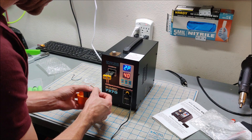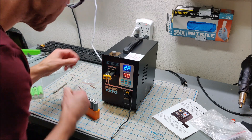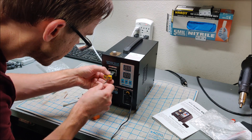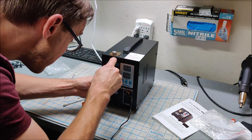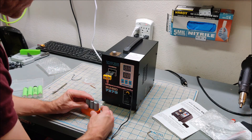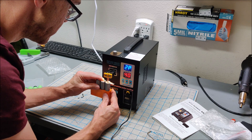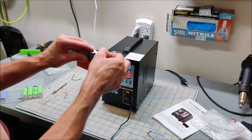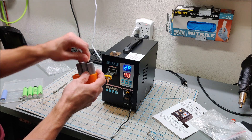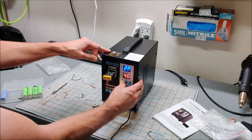That was a weak spot weld — I'm probably going to have to up the current. I want to adjust these needles a little bit; they're a bit far apart, I want them facing a little closer together. Let's try that again with the 0.15 on this battery. After turning it back on and adjusting the pressure — yes, we have a spot weld! That wasn't bad. I think we're going to have to go higher though. Let's push the button and adjust the current.